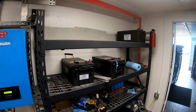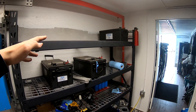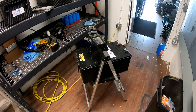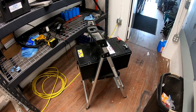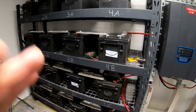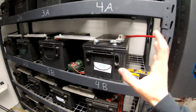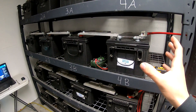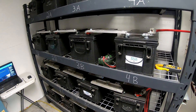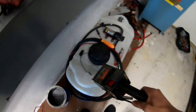We've started pulling the batteries down. Our process was load-checking them on the rack, and when they were good we'd bring them down here, check the acid and water levels and gravity, then move them over to this shelf. This shelf all checked out good — I had my stepdad turn on the electric clothes dryer as a load and we were able to pull 55 amps off this shelf alone, so all these batteries are creating a nice amount of power for the system.